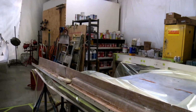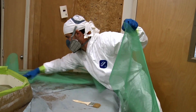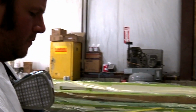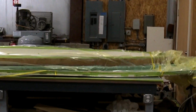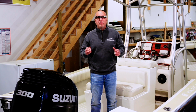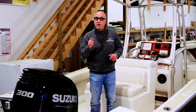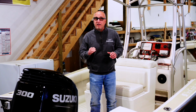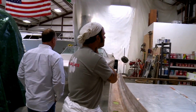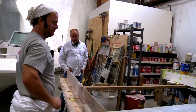With the vacuum bag and the sealant tape prepared prior to us beginning the layup, the men then pulled the vacuum bag over the deck lid part, checking the sealant tape for leaks as we began to pull down a vacuum on the part, making sure the part was staying true to shape and not twisting in any way, so it stays the shape of the hull and we don't run into any issues at the time of assembly.